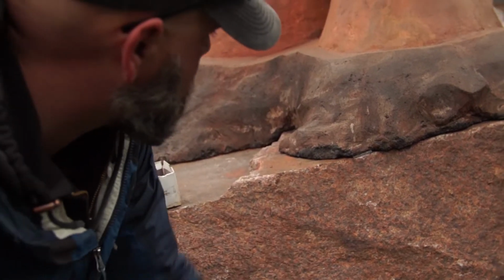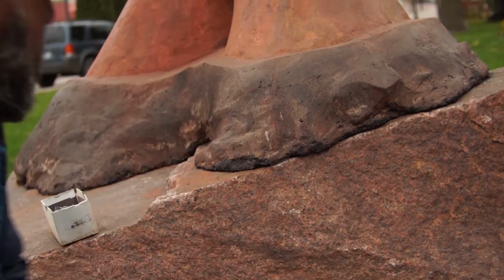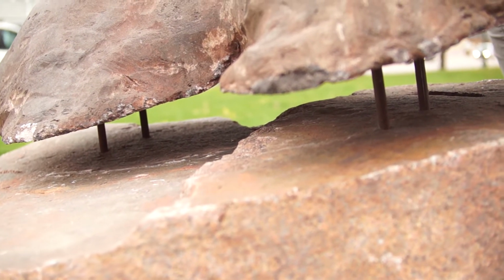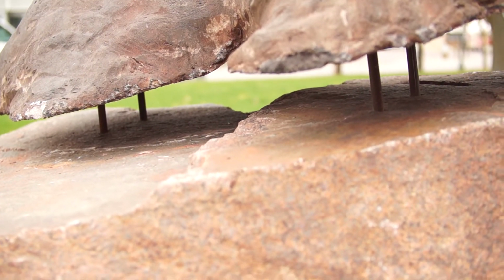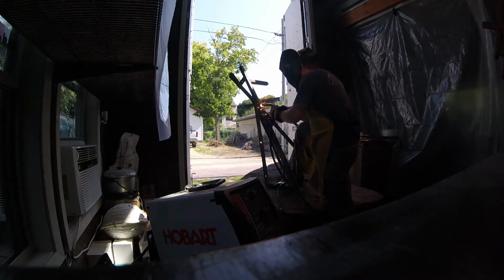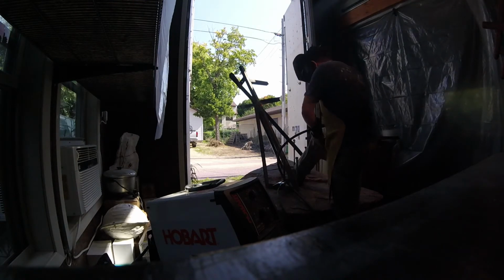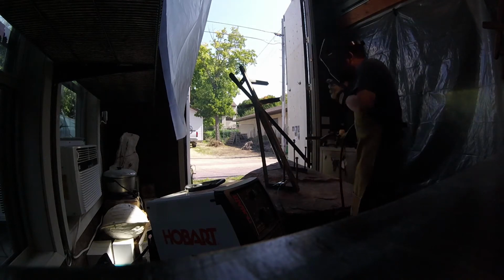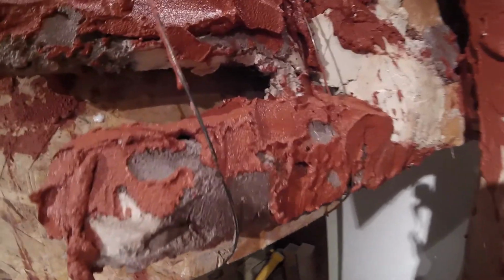And so Jesse Ellerbrook at Heritage Memorial got me the block and drilled holes in it. He drilled 4 pinholes in it that are about a 1/2 inch thick. And that allowed me to drop some rods in those holes and weld to those rods. So there's a steel armature that plugs into the stone at 4 points. The armature builds up from those rods with angle iron, going along the main length of the arms, and then it builds on the palm of the hand, and you see fingers extending from the palm.